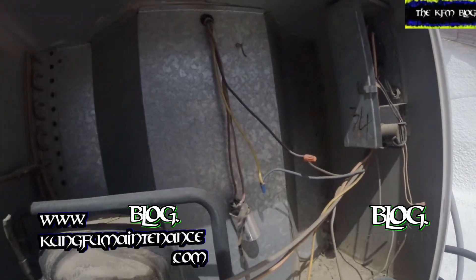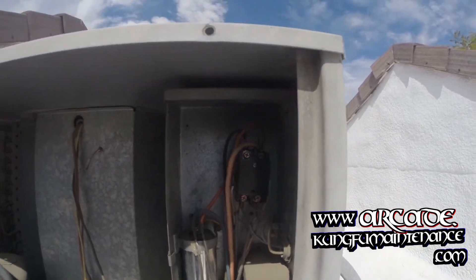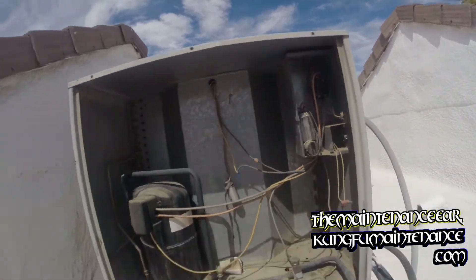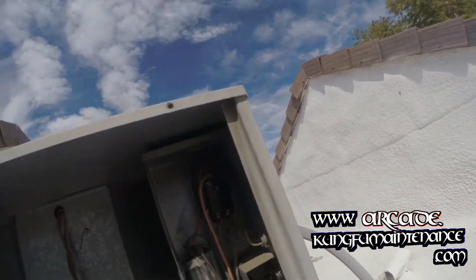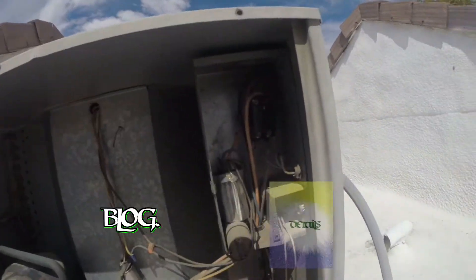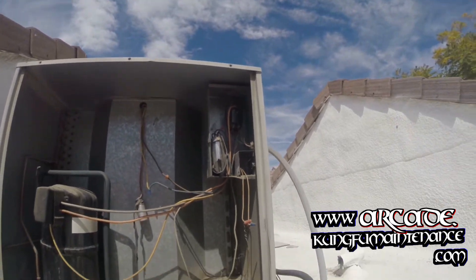Alright, we've got a dangling capacitor and where it's sitting — that's not so good. The wiring looks fairly okay. The question is, is our contactor pulled in? These dust covers are pretty good for the contactor but they do get in your way seeing what's going on, so we want to check and see if that contactor is actually sucked in — rule that out. Obviously if the contactor's not sucked in then the unit's not going to fire up.